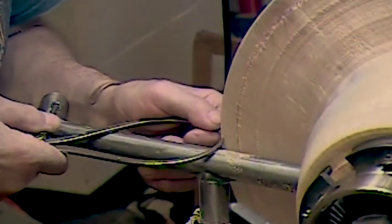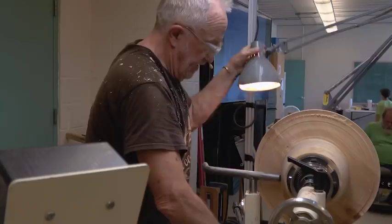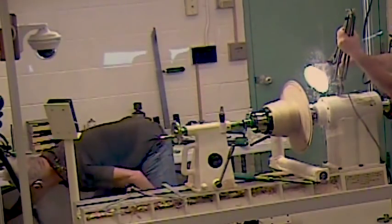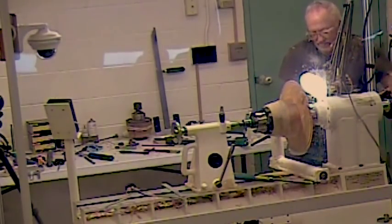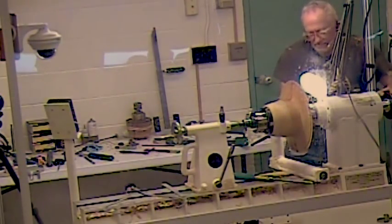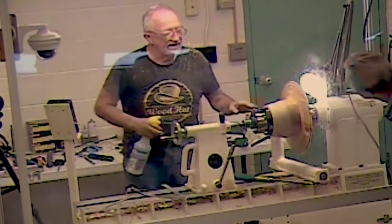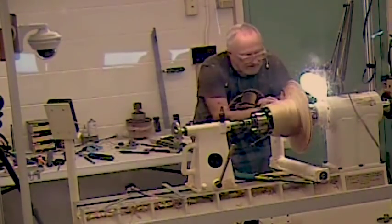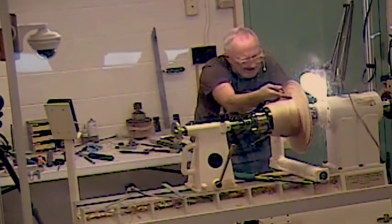So right at the edge is where I'm the thinnest. Back here I'm still a quarter inch. I'm nowhere near. I've got to put a light behind. So I'm going to give it a drink of water right now for all those reasons. I don't so much need the light for brim thickness, and the fact is the discoloration of the wood makes it not translucent very well. But where I really need the light is up inside the crown. And we have some white wood there and we're happy. From this finished edge up to this point, 5/8 of an inch. And that's basically what we have there.